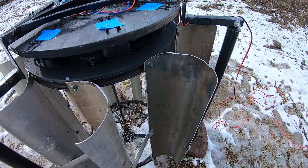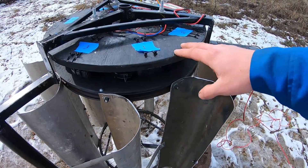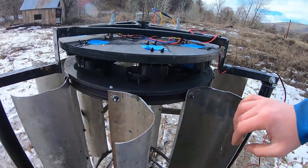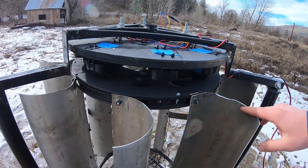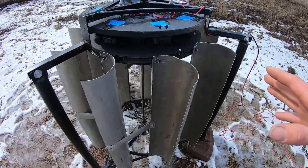The rotor is the part with the magnet — rotor because it spins. The stator is stationary; it's the part with the coils, and it was fairly self-explanatory. What you want is to make sure that all of the energy going into moving your fins doesn't go into bending them — it goes into pushing the magnets across the coils. That's what these braces are for, just to make sure that everything is fairly stout.